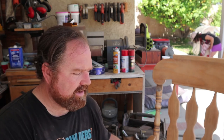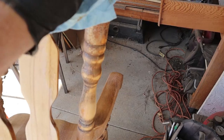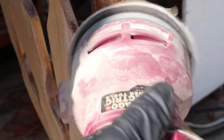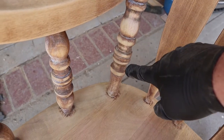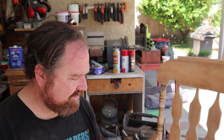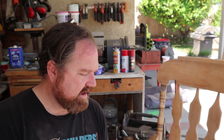So I used the paint stripper and it ended up making a bigger mess than I was hoping and really wasn't that helpful in the long run. Most of the hand sanding was probably the most effective, and then using the palm sander made quick work of really large areas like the seat and the back. But now I have a dilemma — I removed a lot of finish down to bare wood in some places but couldn't get all the finish off in others, giving a really splotchy look. Even with my fairly low threshold of acceptability, I don't think I can accept it as it is.